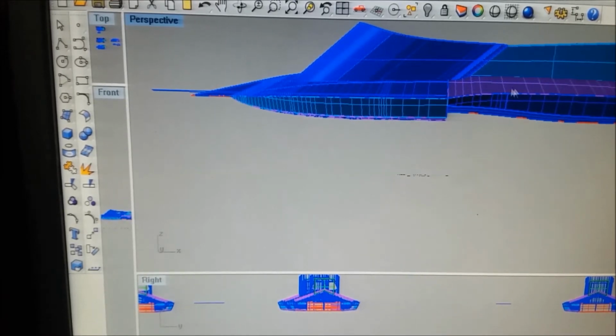And then I did this as a separate piece. The bottom was done as one piece. It was an add-on. But this, because I can't unwrap a twisted surface, I really can. I've done it before. I do airplanes, so you have a lot of surfaces that are changing airfoils from one place to another, and a common way to make the ends of the wing stall last, so you have control just before it quits flying and tumbling, you would have less angle of attack at the tips, so that as the nose rises and the wing starts to stall inboard to outboard, the last thing flying is out there at the ends, and all your control surfaces are on the end, so you can still control it.